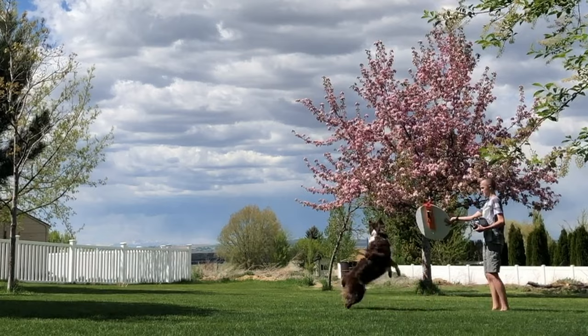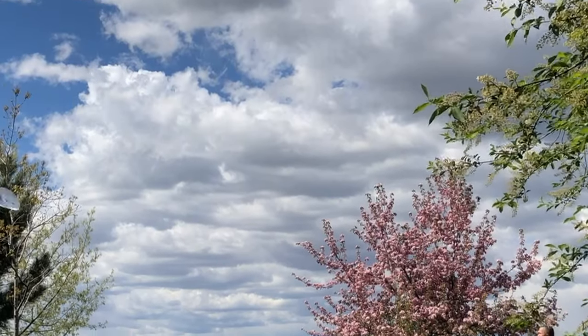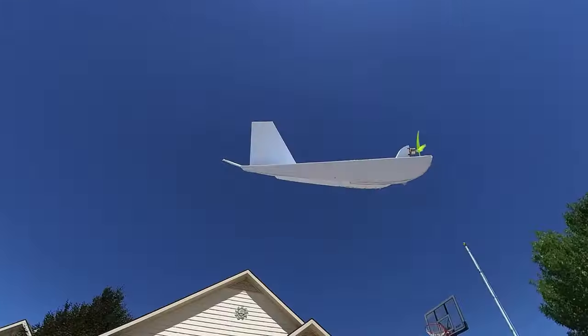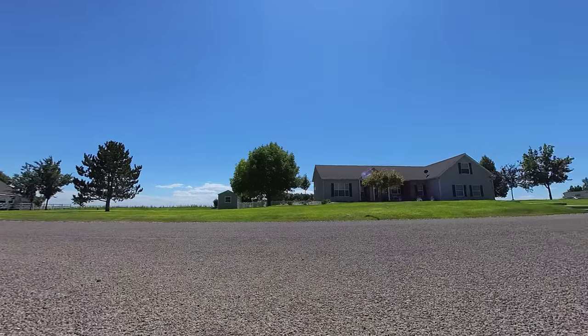The next tip: choose a plane that is actually doable to build and to fly. For me, I was determined to build mine and I wasn't so good at it. The planes that actually worked best for me were the FliteTest Nutball and the RC Test Flight Sled. I wish I would have had that sled sooner because it's a great learning plane — it already has the landing gear built in place. It's not with wheels, but it works very well.